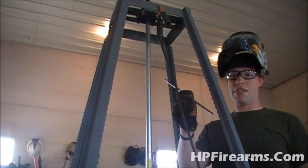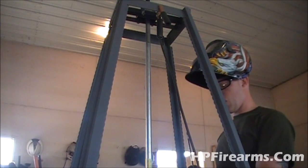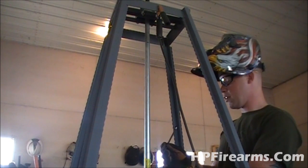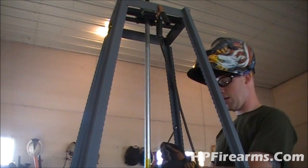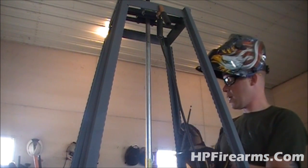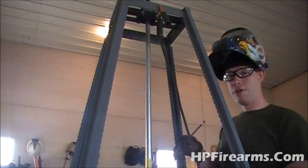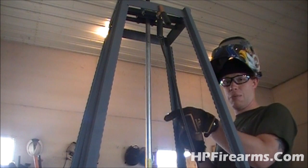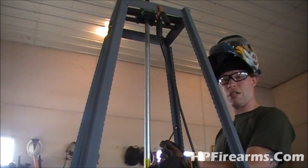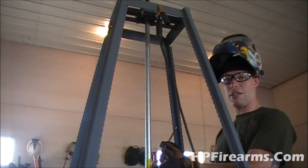My plan for the support is to use some 5/16-inch solid steel rod, and I've got a washer here, the same kind we welded on top. I want to bring this washer up around the shaft of our spindle and find a good placement for it — not too low, not too high. I'm going to bring this rod in at an angle so it meets up with the washer and also sits back against our frame. That angle means it won't flex, whereas coming straight across from the four corners would still allow flex. So coming in at an angle creates a more rigid mounting around the base of the shaft.